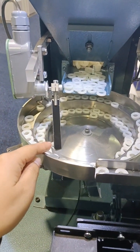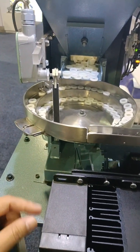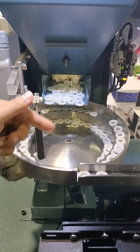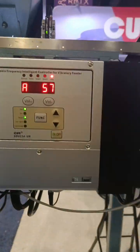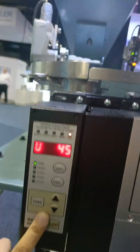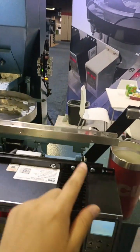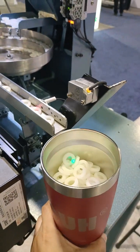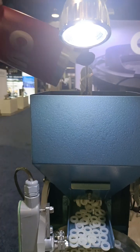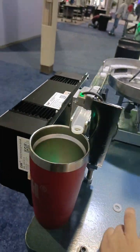And then this is a rod sensor, connected to the hopper, and when it gives a signal, the hopper will automatically feed to the ball feeder. Now it has totally stopped, because the ball feeder also gives the signal to the hopper. So when the linear feeder stops and the ball feeder stops and the hopper stops, the signal comes from here. You see here the ball is full. If I put the ball back here, because I set 2 seconds, after 2 seconds it will restart again.